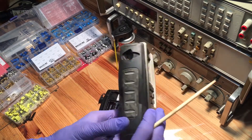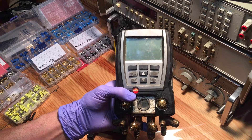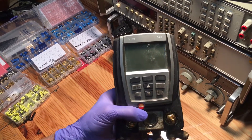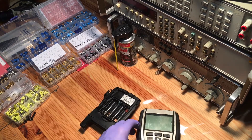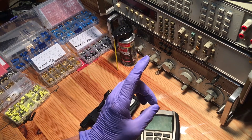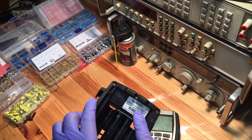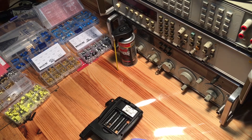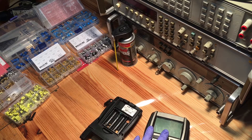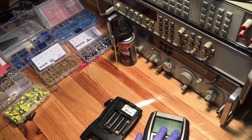For nitrogen testing, there is one fact you must understand about pressure gauges: using old-style analog gauges for pressure testing is just about worthless unless it's a really big leak. But when you have a device like the Field Piece SM480V or this Testo 570, there is a feature where you can actually plug in power and leave this on for one day, two days, three days, 72 hours. I like to do pressure tests starting on a Friday when I'm not going to work over the weekend, and leave a unit pressured up to 600 psi if that's what the manufacturer calls for.